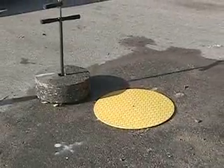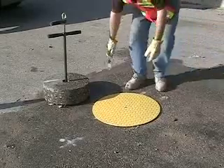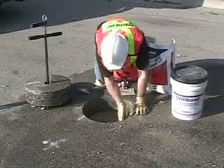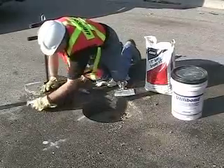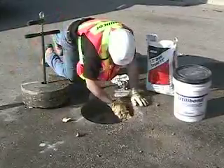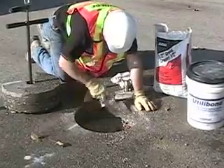After the repair work has been completed and the hole backfilled and compacted as required to two inches below the base of the pavement, you are ready to reinstate the core back into the roadway. Remove and stow the road plate. Then carefully clean the surfaces of the hole in the pavement and the core using a wire brush to ensure a good bond. Then using a damp cloth wipe any loose debris from the core and the sides of the hole. Proper preparation is crucial to a proper reinstatement and a good bond. Take your time and do it right.